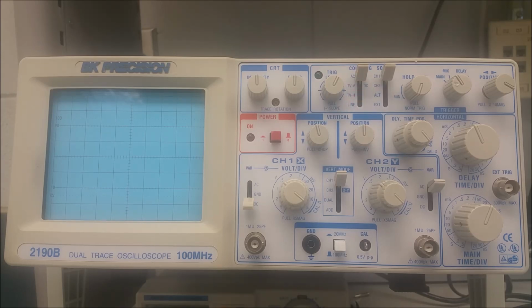All right. Now let's go to number 29, which is the trigger level. This is actually the slope control. So trigger level determines where on the triggering waveform the trigger will occur. A counterclockwise rotation means a more negative triggering point, while a clockwise rotation means a more positive triggering point. When it's pulled, you go into negative slope. So it's a push-pull switch. The in position selects a positive slope, and the out position selects a negative slope as a triggering point for the main sweep.